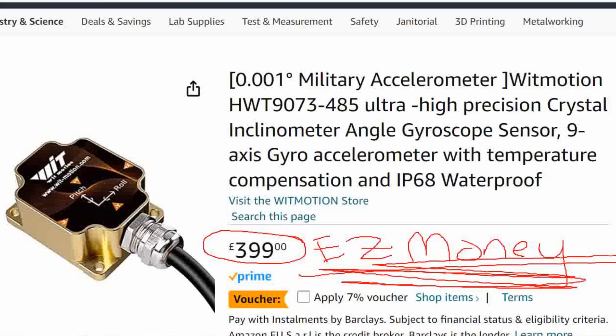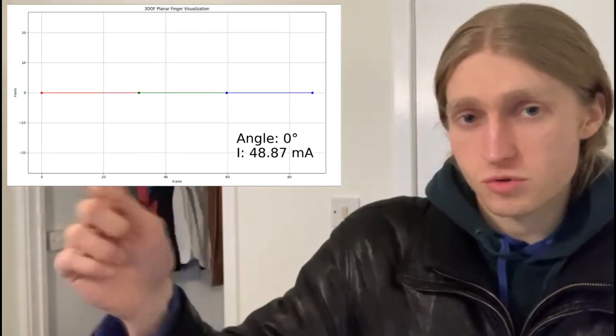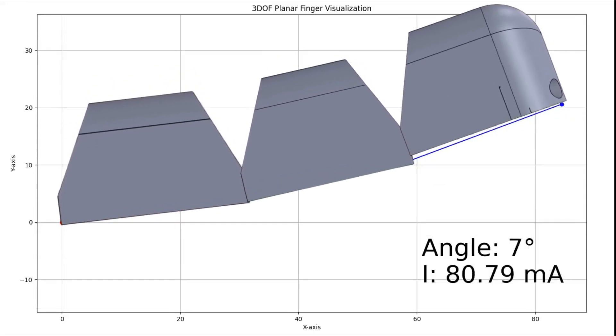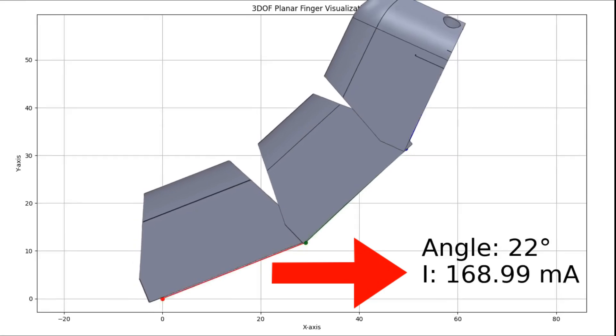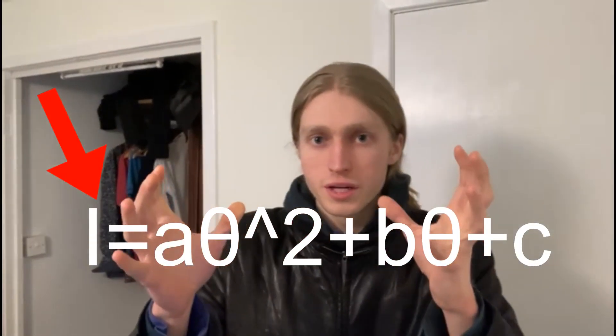It's been like four days, but turns out if you want to be able to make a gesture between those two spaces like we're gonna need to be able to do, then you need to actually know where in the rotation we actually are. A smart, financially secure person would probably buy more sensors to do this. My video, my rules. I've made this kinematic model that describes how our finger moves from a planar perspective. Each line represents one of the finger joints, so let's put those on and move it. When the motor moves, pulling the finger in, this current reading goes up because of increased tension. Anyone remember high school maths? I sure don't. But I do have Wolfram Alpha and a lot of patience, so we can form this quadratic that when rearranged can relate the angle value to the current value, giving us position.